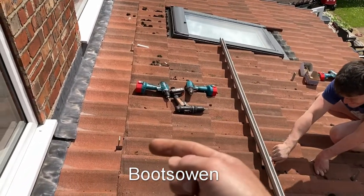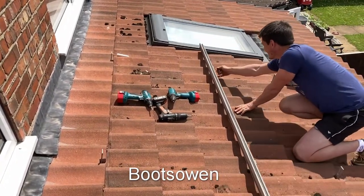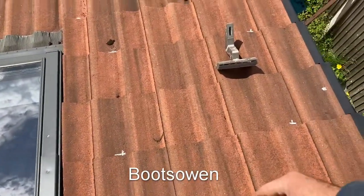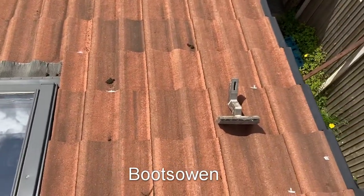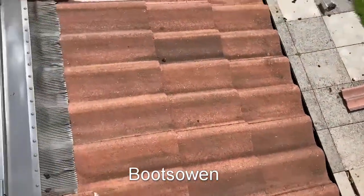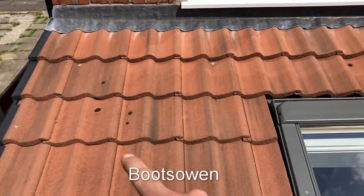This video will be about how you fit these brackets under the clay tiles on this roof. It's been really easy so far. We're a third of the way — we're going to put four panels in the center, two over there, then one where I'm standing and one beneath. We figured out where to put the brackets by going down to the edge of the roof and looking back up.